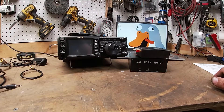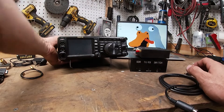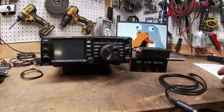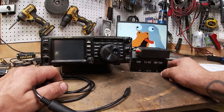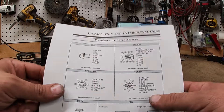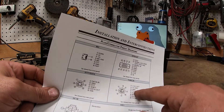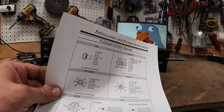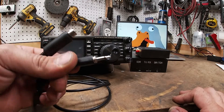You're gonna need to make this cable — what this is is the 8-pin that plugs into the linear amp port. All this does is when you transmit, it sends a signal to ground and it activates the relays inside this box. If you look in your manual on page 17, you have a pin-out for that jack. Pin 2 is your transmit ground, so you're gonna take that voltage from there and run it to this. It's just the DIN plug and then a little mono eighth-inch jack.